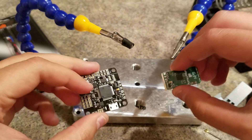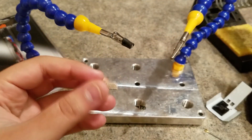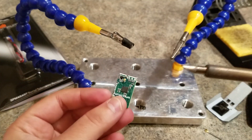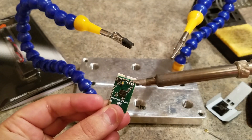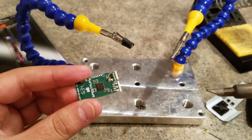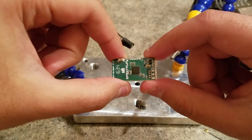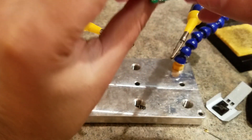So let's go ahead with removing the connector. The best thing to use for this is on your soldering iron using a big flat tip. That way, what we're going to do is heat all pins simultaneously and then remove the connector off, which means no having to suck solder out or use any of that copper strand stuff to suck it out. This will be much easier. So let's place this right here on my helping hands.